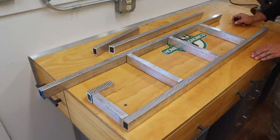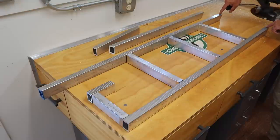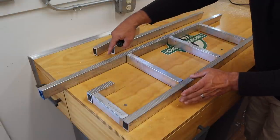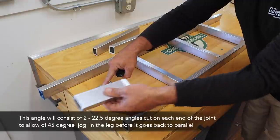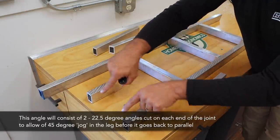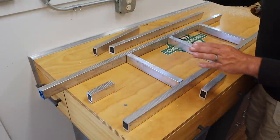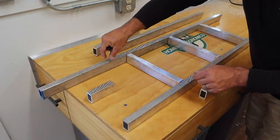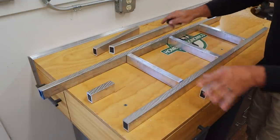Right now I'm pretty close to having all the cuts done and I've got everything laid out how it's going to be leaning off the side of the tailgate. Down here are the bottoms of the legs, which I cut at 22 and a half degrees, and then I've got my first, second, and third step. What I need to do now is figure out the cuts to make this come at an angle, and this is just a spacer so I know where these need to go. These two pieces will be connected to the hinge point so this can be folded up into the bed, but I may need to adjust the steps down a little depending on clearance. After that I'll put it on the welding table and get it all tacked into place.